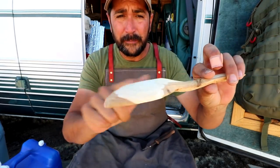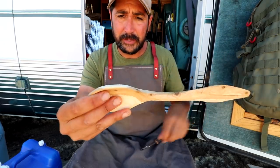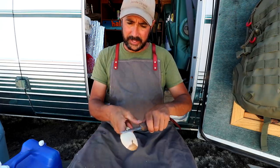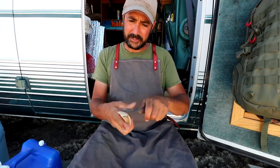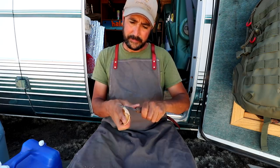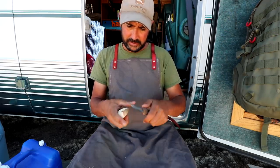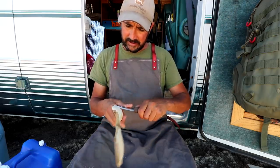At this point when it gets down this close, I'm basically just trying to smooth out most of my cut marks so they're not super deep and defined. To do that I do a light shaving with the push cut — just let the knife go back and forth with a pushing motion, very lightly grazing the surface. That way it's just hitting the high spots. If I use too much pressure it's going to dig into the low spots as well and I have to start all over evening it out.